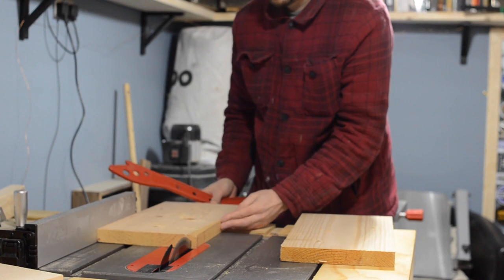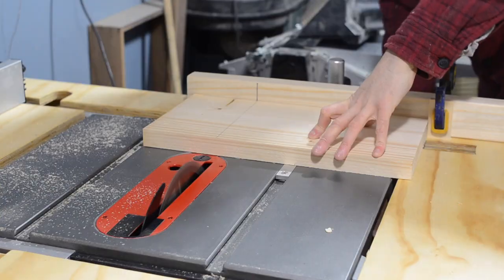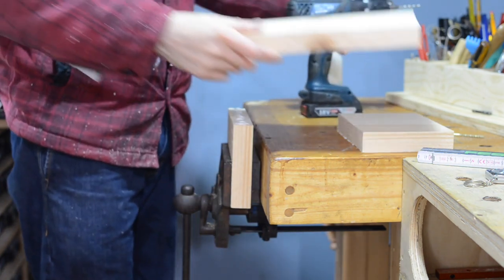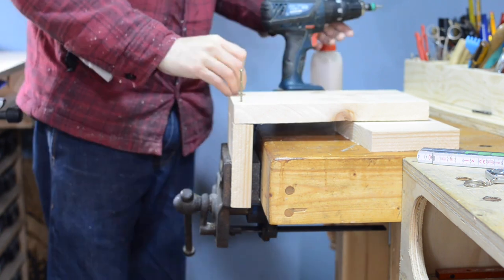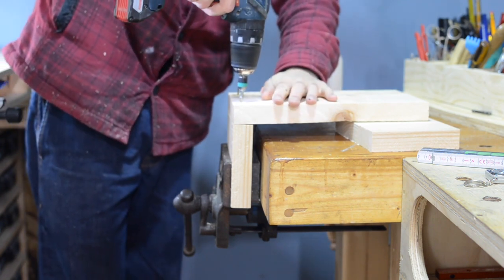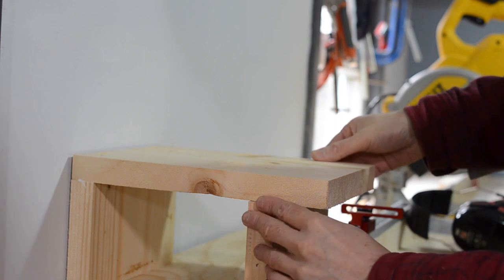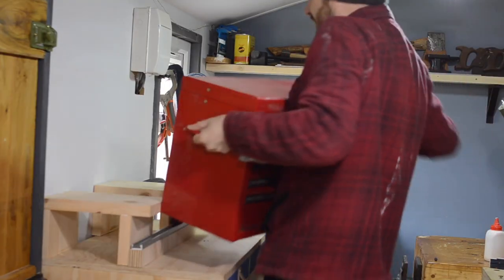With that done, I can then rip them down on the table saw. So my plan is to try and get this box behind the fences on the mitre saw. Now it's too wide to just fit there, so I need to make some little feet for it to go on. These bits of scaffold board are nice and chunky because there's a bit of weight to that box, so they're just going to get glued and screwed together. I get the first foot screwed on in the vise, and this is going to go up against the wall, and then the second foot goes along the fence itself, so I get that put in place in situ, so it's the perfect position. I'm making two of these so the box is supported at each end, and as you've got that open space under it, I can probably slide rulers and long things like that in there.